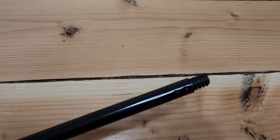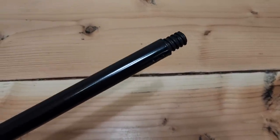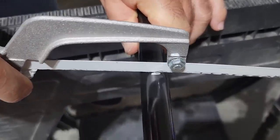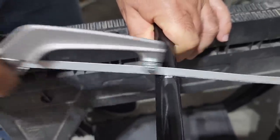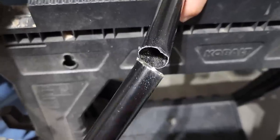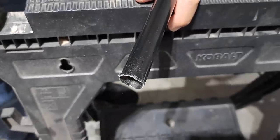On the handles, we don't want to cut off the top — we want to cut off the bottom with the screw end. So we'll mark it exactly the length we want and use a metal saw because these handles are metal. When you're cutting metal, use a good blade that's meant for metal and go slow. Once you get it cut all the way through, just snap it — it'll come right off. This is not the thickest metal, so it's good to snap.